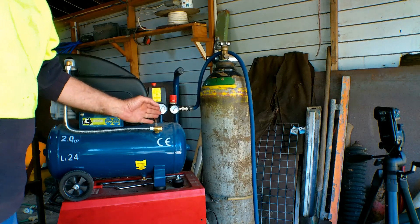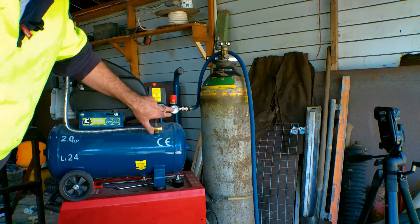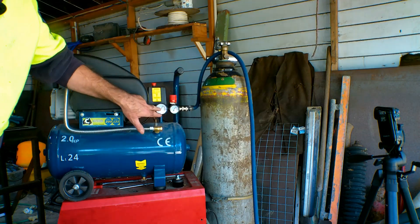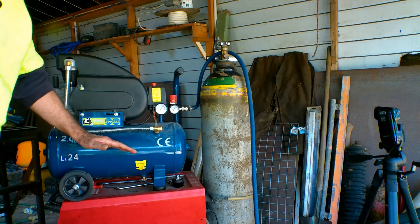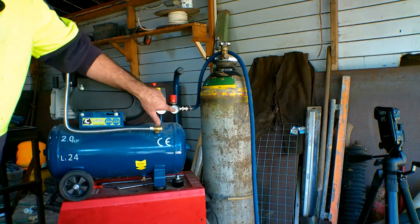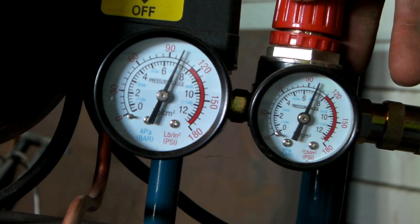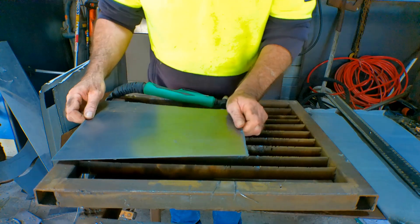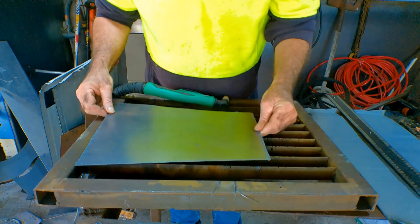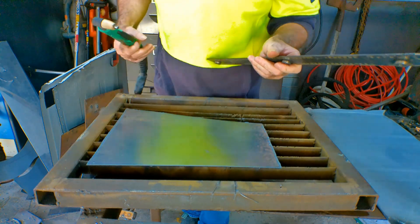As you can see, we'll pump this thing right up. We're sitting at about 110 PSI, and the delivery to the torch is also 110 PSI. I'll show you what this can cut and how long it runs before we run out of air, and then I'm going to play with the delivery to the torch. We've got this flat out — we'll try and cut about three mil plate with the little compressor fully charged up.